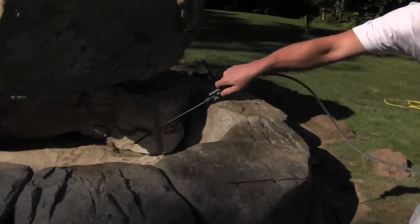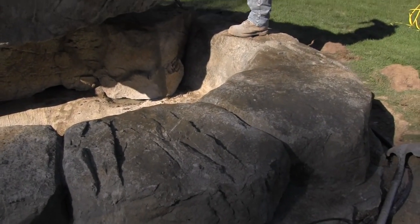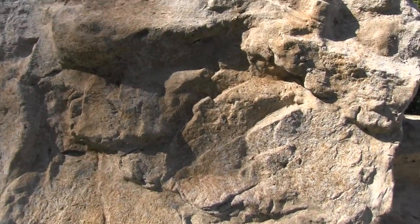So what's nice about this is that the color that goes on this stuff is actually adding a covalent bond, because the color is an acrylic based color. It's made with acrylics. There's a plasticizer in it to try to keep it emulsified, almost like hydrogenation would be in food sometimes. And so we're adding that color, but now you have a bond because you have acrylic to acrylic, and you get a covalent bond. It's really nice. It gives more of an effect, because I have our Forton product inside here, so you get some colors that are lighter and darker, and that's what you want in a rock.